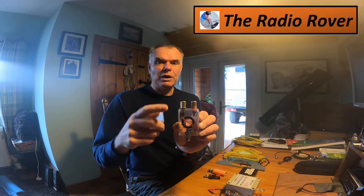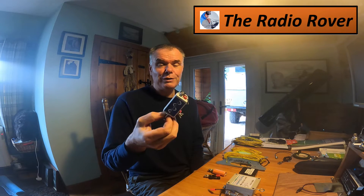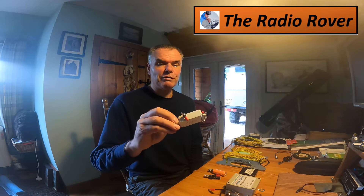When I made this, I made two terminals — one for the antenna wire and one for an earth — but I never actually use a ground wire with this. I connect five meters of coax to it and that acts as the ground because I'm only using QRP. You do lose a bit of efficiency with these, as you do with anything that's a core with some wires wrapped around it. This is a much better one by Colin MM0OPX — I'll link his video. He's done an incredible amount of work trying many different types of core. This uses a different core and it's 64-to-1, a different ratio, but he found this to be the most efficient.